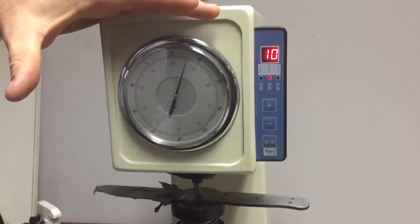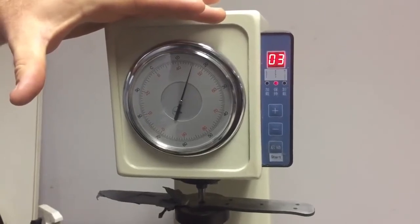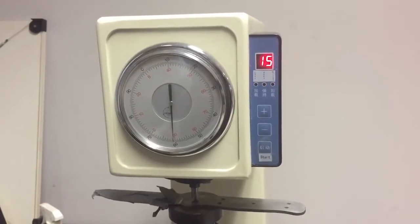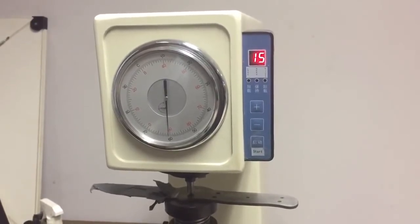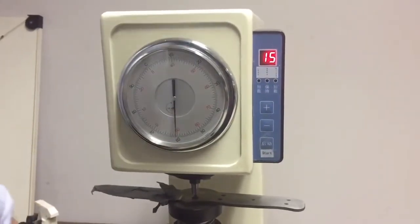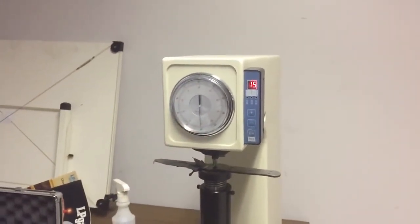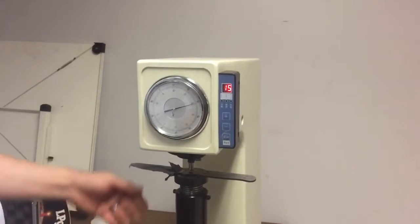So here we go. This blade was manufactured by a guy by the name of Darren Hay from B Blades. Darren was shooting for a hardness of 59 and in this case he's ended up with a hardness of 60.5 according to the dial, which we know is probably reading a little bit out — about 0.6 under. So it's actually probably closer to 61, 61.5. 61 Rockwell is a very fine knife, so he's done a good job of his heat treat.